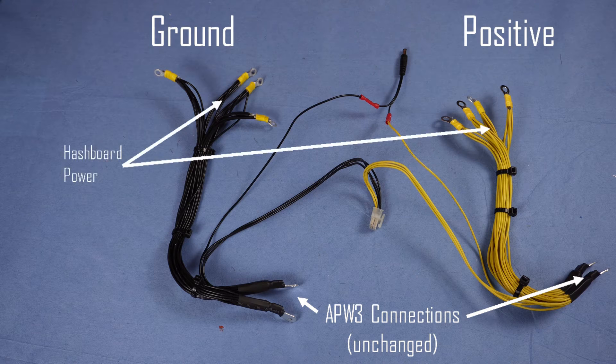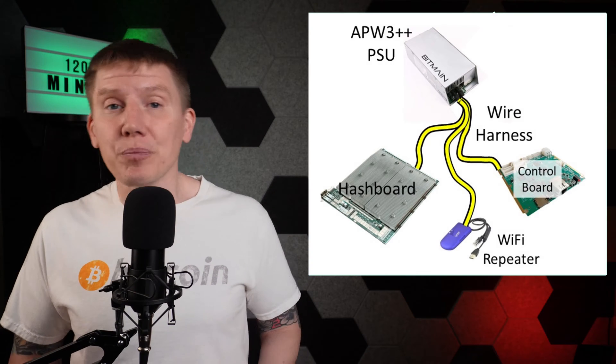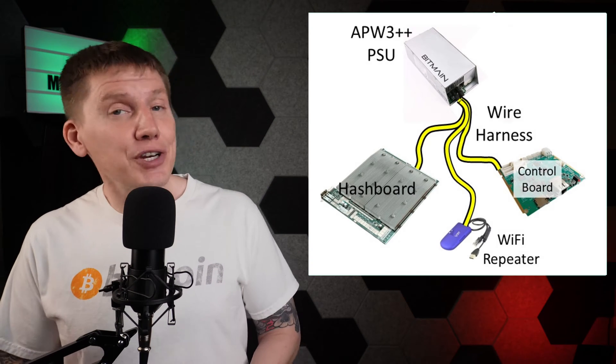This step is only necessary because I want to connect a Wi-Fi repeater to my miner. If I was directly connecting the miner to an Ethernet cable, I would just group this wire in with the rest of the power cable. Here is the completed wiring harness — I have four positive and four negative connections, a connector for the control board power supply, and a connector to power the Wi-Fi repeater. With the 120-volt power supply and wiring harness both completed, the next step is to put it all together. But this video is getting a bit long, so I'll be finishing my 120-volt miner build in the next episode. If you've liked the build so far and want to see the completion of my budget home immersion miner build, hit that subscribe button so you don't miss any new episodes coming your way.